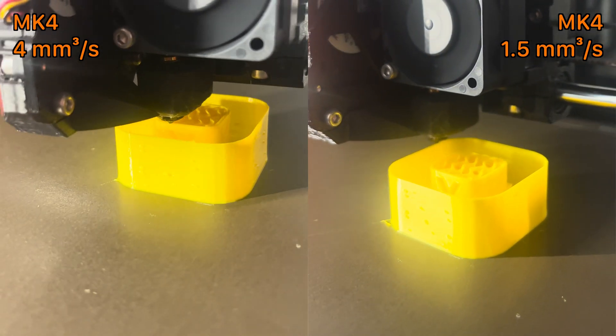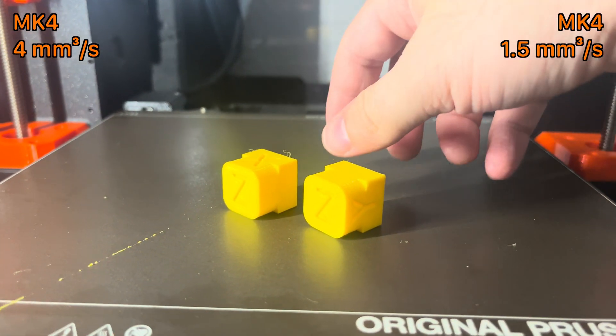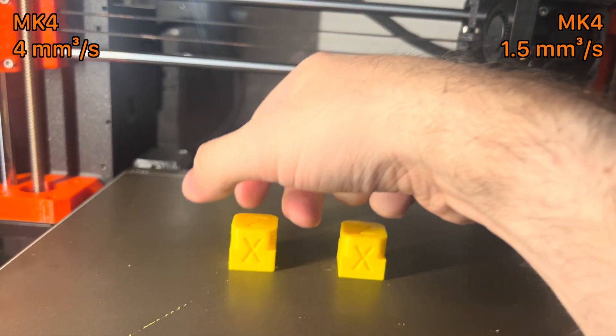The main outcome is that my printer survived the stress test — it printed the model. The quality wasn't as good as a slower print: it had more stringing and some gaps in the filament. I wouldn't recommend printing at 4 cubic millimeters per second; maybe 3 is good enough. But quality is not the main concern here — even with PLA you can slow down to get better quality. The main question was reliability: can you be sure the model will print in a reasonable way, not extremely under-extruded with missing layers? And with this modification, you can. I pushed the printer to a certain limit and it survived, which is what I expect from Prusa.